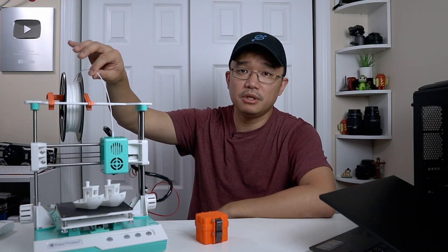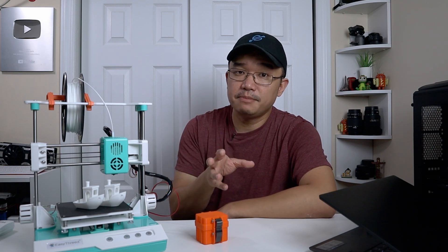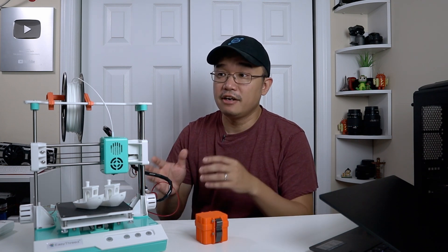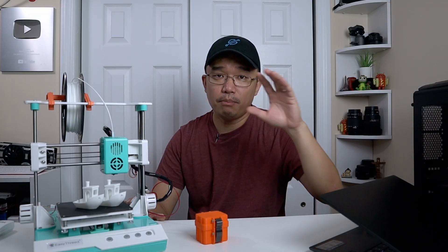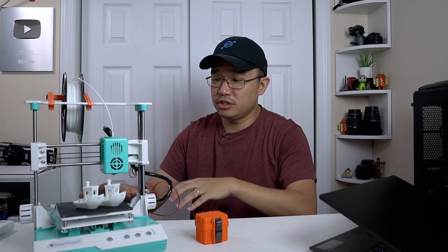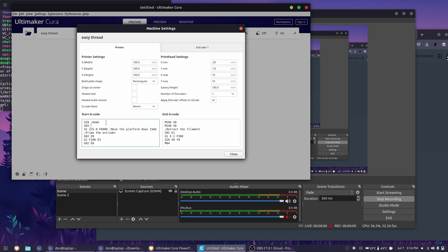The first thing we need to do is measure 120 millimeters from the filament itself, according to the guide. Once you mark it, you follow the steps to force the printer to extrude 100 millimeters. This tells you if you're under-extruding. My speculations were correct — it was under-extruding: instead of 100 millimeters it only extruded 94 millimeters. Plugging those calculations into the website gives you the correct E-step settings. Unfortunately, the EEPROM on this printer won't save, so I added the corrected E-step code to the beginning of the machine settings in Cura so it loads correctly on every boot.